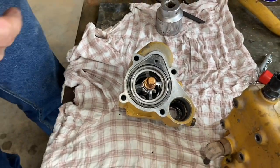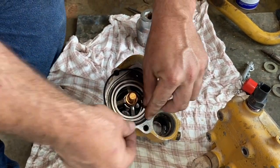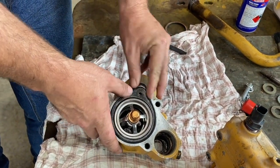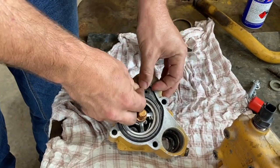What seals the regulator housing to the base housing on the engine is this o-ring. It's a way better idea than having gaskets — it makes for easy disassembly and assembly. You don't have to worry about anything drying; you can just whack it straight on and fill it full of coolant.